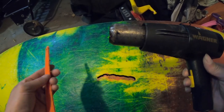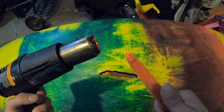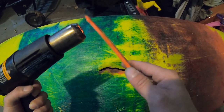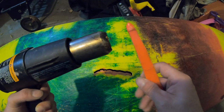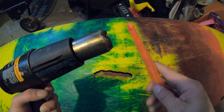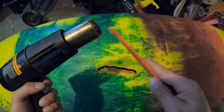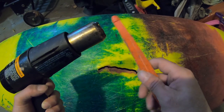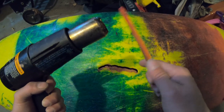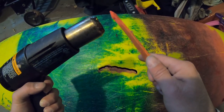Start to heat my stick before the boat itself, and you'll start to notice it gets wet — real wet looking — and that's when it starts to get really soft and sticky, at the temperature you want to start operating and welding at. But you don't want to get it too hot and too melted because you'll break down the plastic and it won't work as well. Continue to heat this — just start feeling it on the tip when it starts getting a little malleable. Roll it too, because one side will stay cooler than the other, and when you apply it, it won't go on evenly.